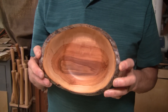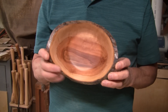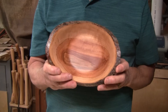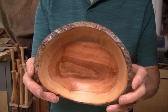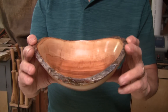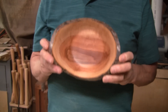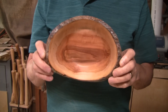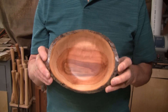That finish just brought it all out. And speaking of the finish — I said I did something a little bit different. I started with one coat of shellac-based sanding sealer, the Zinsser SealCoat, and then I decided I wanted to see what wipe-on poly looked like. So I put two coats of Minwax wipe-on poly and I just love how that looks. This was a fairly easy live edge bowl to do out of a piece of wood that just didn't look like it was going to amount to anything. But it sure did.